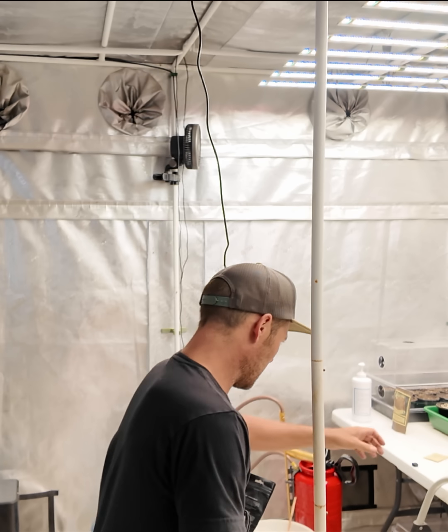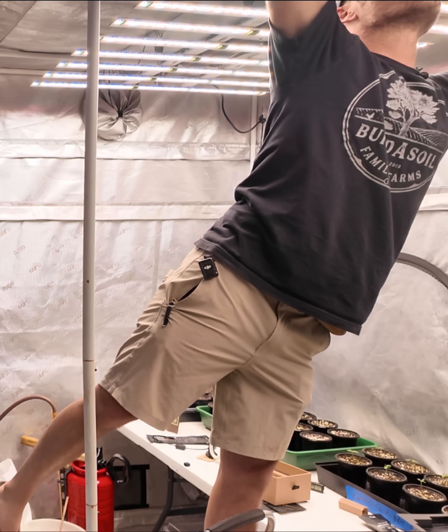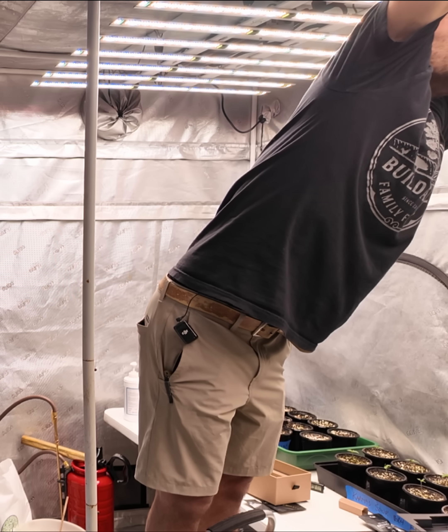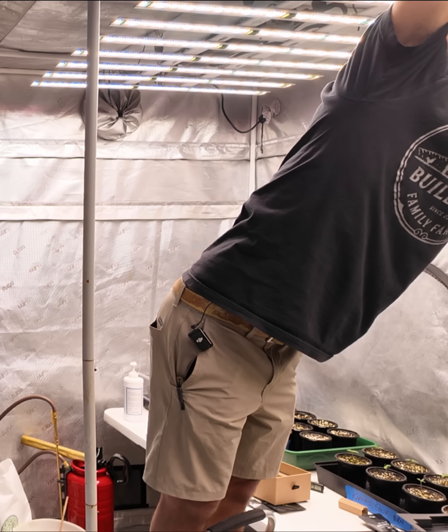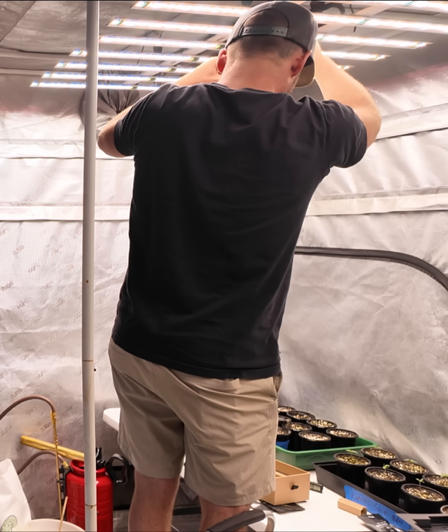I've got extras that came with everything, so this will go from light to light. I really only hook one end up to the first light and then daisy chain to the second light — it's all on the controller. For the daisy chain, I want to go in the out, not the in. It makes sense because the supply is going to come in, tell it when to go on, and then this one goes out to the next light to relay it.